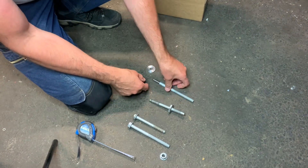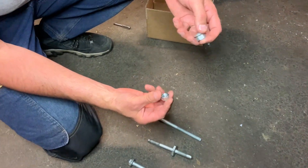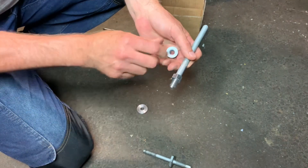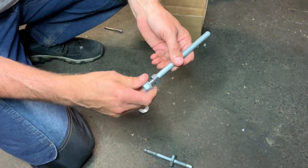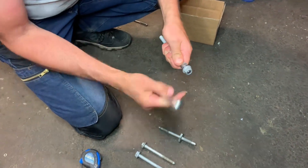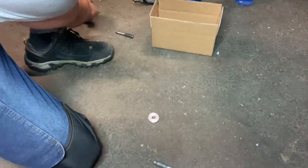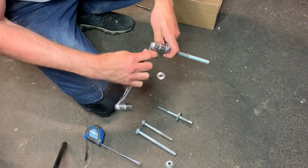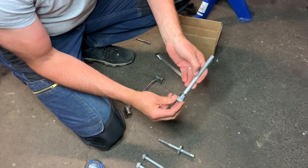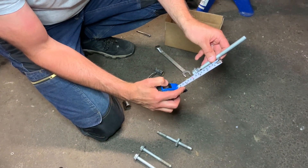To be able to screw it in, now that we don't have a hex piece, what you do is use one of the collar nuts and then there's this extra nut — the locking nut. So what we do is screw this on first, then take one of the collar nuts and screw it on far enough that it's flush — that makes it easier to measure. Then you screw the locking bolt up against the collar nut, and using two wrenches, you screw them up against each other and tighten it. That way, this collar nut is now going to act as a bolt head. We're going to be screwing this up and measuring so we have about 90 — a little bit more than 90 millimeters — sticking out.